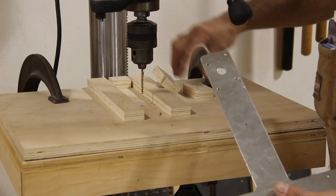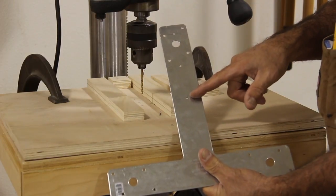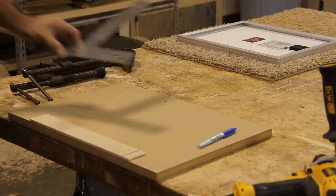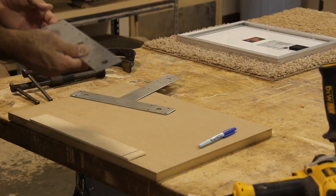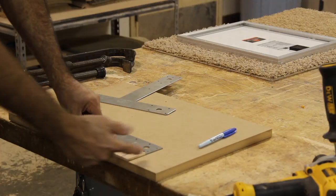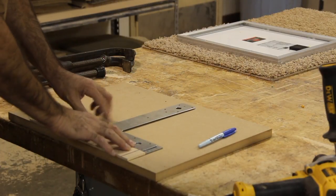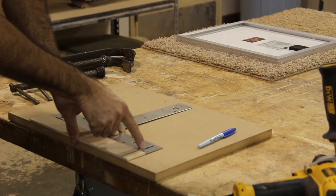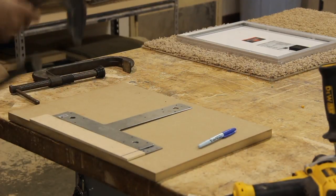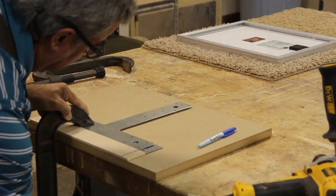Remove the blocks and make sure you clean out the debris for the next person, so they can start by drilling the first hole, then put in block two, then block three, and they'll be all set. Now our next step is to take both of our pieces. I'm going to set the first strap so that it is nice and even with this edge, and then set the T-strap on top of it, sliding it down so that this end of the T-strap is even with this blue line. Now that we have that all set up, we'll take a couple of C-clamps and put them on to hold everything in position.